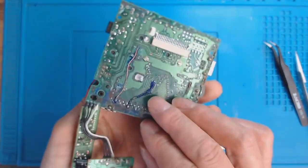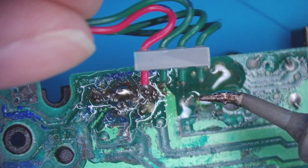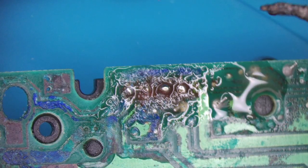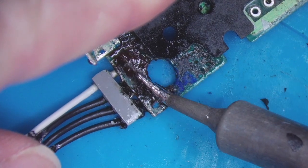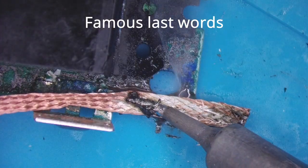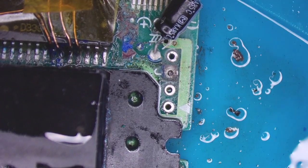The first thing I'm going to do is give the board a good clean. To make cleaning the motherboard easier I've desoldered both of the daughter boards. The wires just disintegrated — when you've got one left this could be the end of it before I've even started. Those wires can easily be replaced. It looks like there's four good pads and nothing there. A light brush with this fiberglass pen. With both boards removed, we'll pop this into some vinegar and allow it to have a soak.